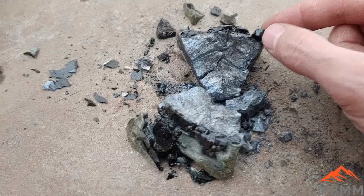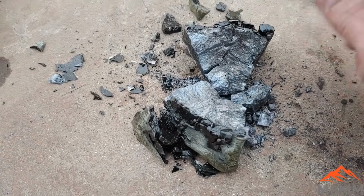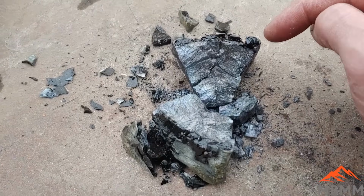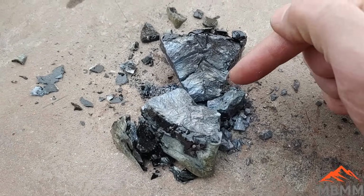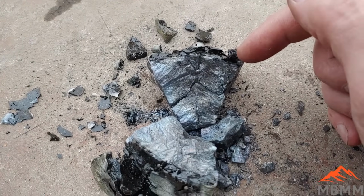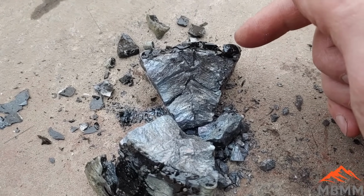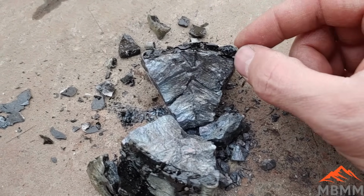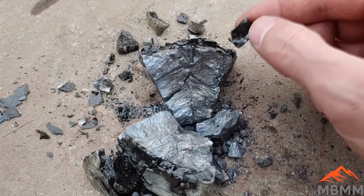So another interesting thing here, just kind of an observation. I mixed 100 grams of soda ash in here, I think. That's what I remember. And 25 grams of silica. And we're left with hardly any slag on top compared to our very first run when I added the sulfur and reduced all the base metals. So there's a very thin little layer here, and it's very, very glassy.